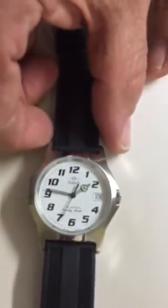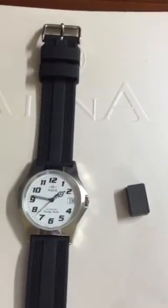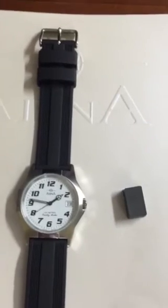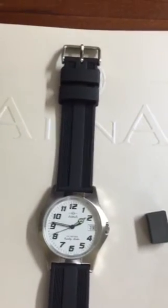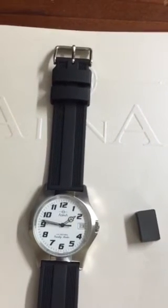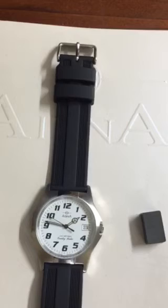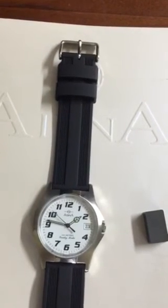It's something to be really aware of because it comes in all shapes and sizes — magnetic mattresses, wristbands that you might wear for therapeutic purposes. It's quite a frustrating but common occurrence for us to see watches coming in that are working in every way, shape and form but are apparently losing time. Normally it's a magnet that is causing the problem.